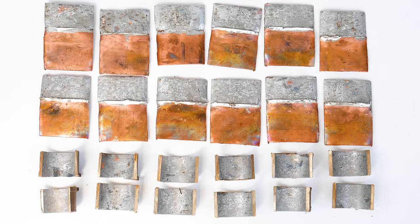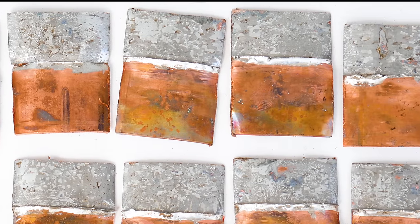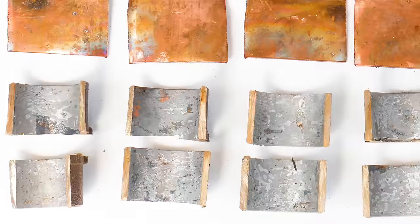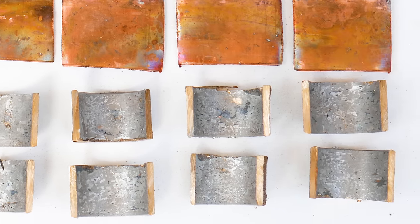So I soldered 3 ball valves the same way, and I cut and opened up the soldered portion so we could see how well it went. Personally, I've had some leaks not using this method with lead-free valves, and ever since I started applying the new method, I haven't had a leak, and we can see that the proof is in the pudding. We almost got 100% coverage on all 6 joints, which means it's good.